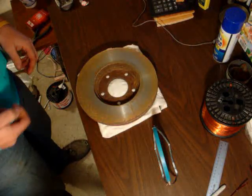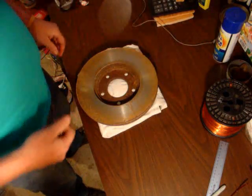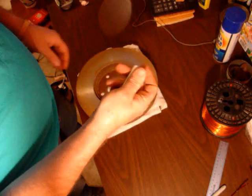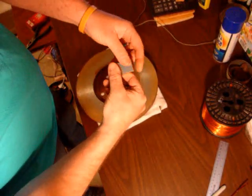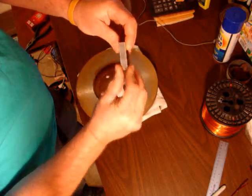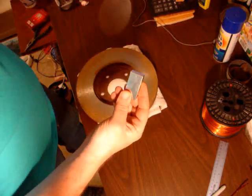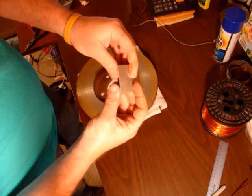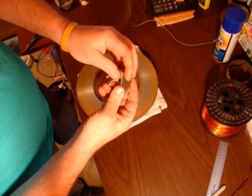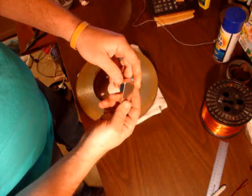Hello, I'm Scott Brown with Green Wind and other Home Energies. This is a neodymium iron boron magnet — it is one inch by two inch by half inch. Notice this nickel plating here, which actually protects the magnet, seeing as this neodymium iron boron is very unstable and wants to corrode very fast. This damage is probably from slapping — don't let anybody play with your magnets, because it will mess them up.